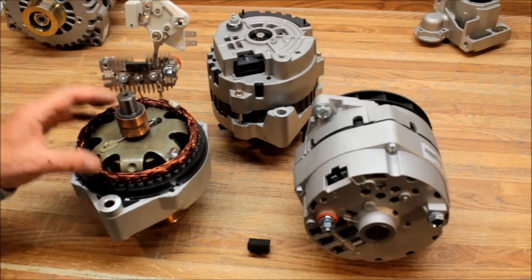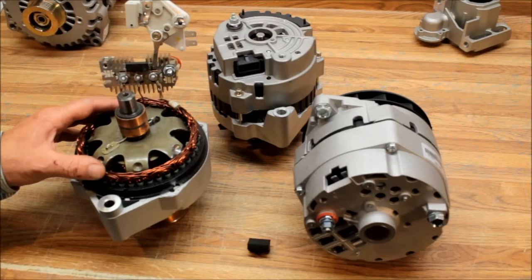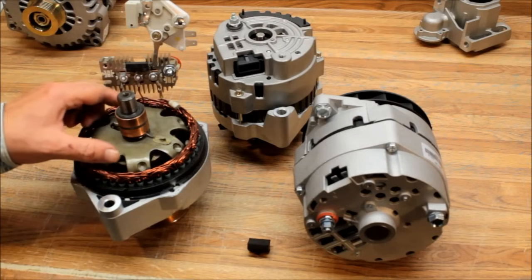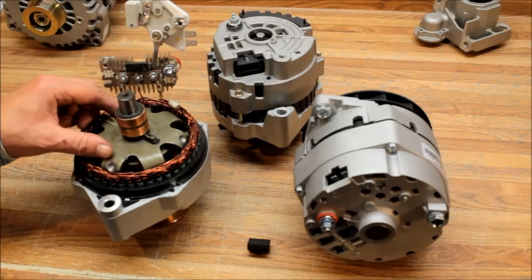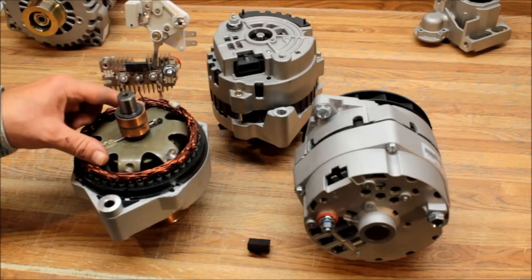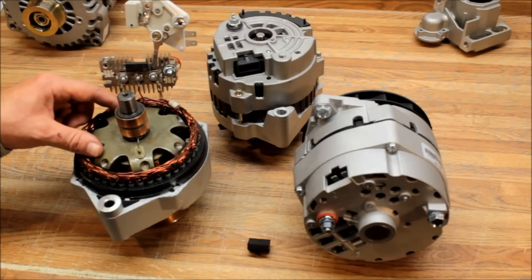The diodes do let a very minute amount of power back into the stator, keeping its magnetism low but somewhat there. The rotor basically has no magnetism other than residual magnetism. Self-exciting units work off the residual magnetism left over in the stator and rotor — like a nail made into an electromagnet that retains a little magnetism after the battery is removed.